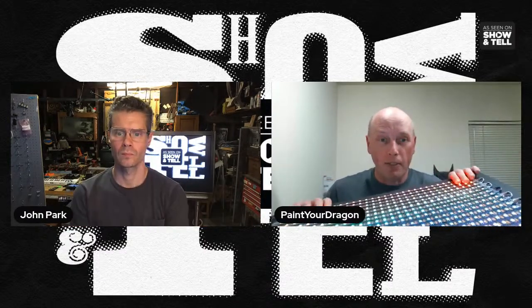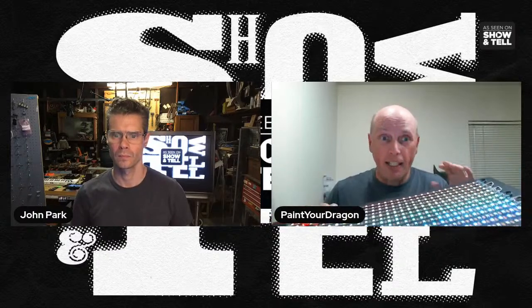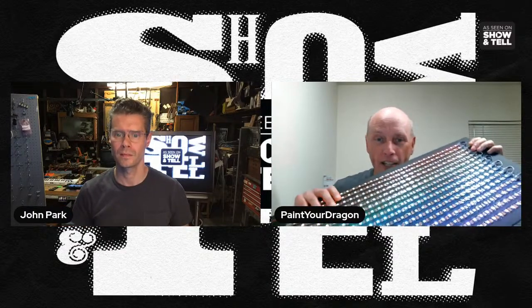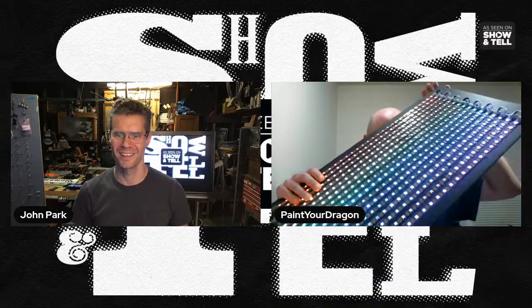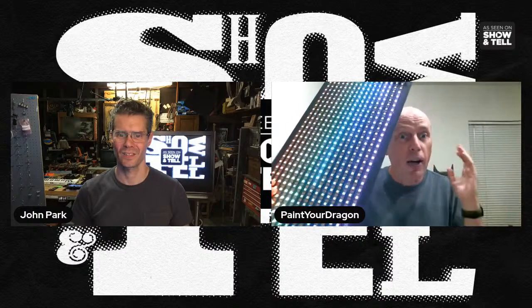It runs on the M0 and the M4 chips, but there's a chip shortage, and those are hard to come by. So a while back, I ported it to the RP2040 chip, and then last week I got it working on another chip we can get, the ESP32S3. There's this LCD controller peripheral on the ESP32S3, and I needed to learn about it. And there's this kind of hacky thing you can do where instead of using it for an LCD, you have this parallel output that's all using DMA. There's very little CPU overhead, so you can do stuff like this and still have a lot of CPU available for your own tasks.